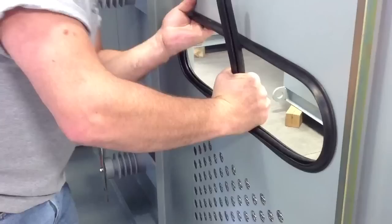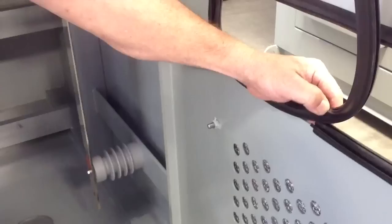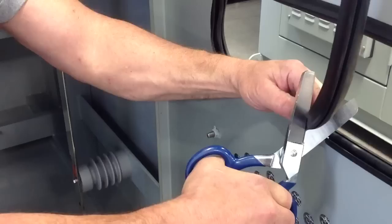So now I'm going to check to make sure that my gasket's on all the way around. I'm ready to cut the seam. I like to go at least a half inch past. You can go a little bit less, but then you may come up short. And again, clean cut — as clean as you can get it.